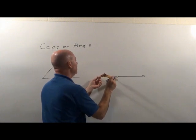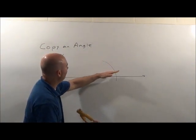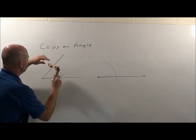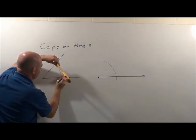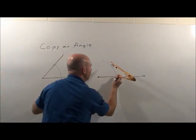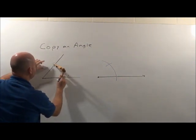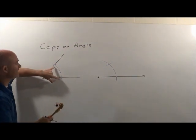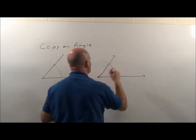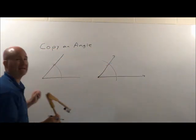Here's what I'm going to do. I'm going to put the end over here so I can make two points that are equidistant from the vertex point on this angle. I come over here and make a point that's equidistant also. Now I know I need to create this line here, but I don't know how far up to go. This is where that measuring piece between them comes in handy. I'm going to come back to this angle, put this right where it crossed that path, slide it in to where it's touching right on that path, and if I come over here and do the same, you're going to see it creates the exact same angle opening.